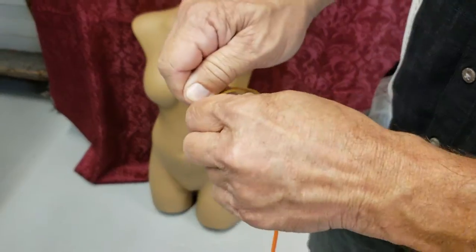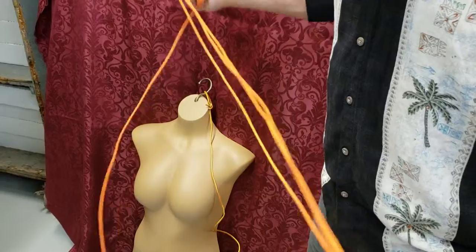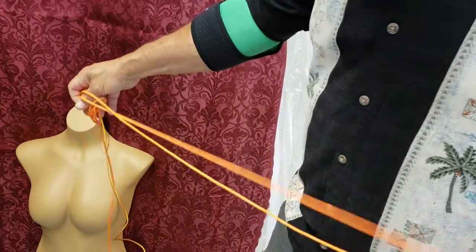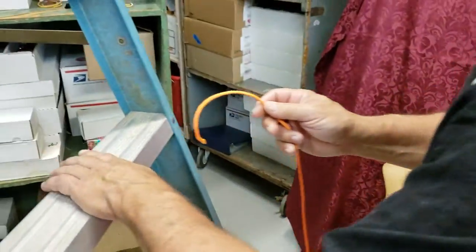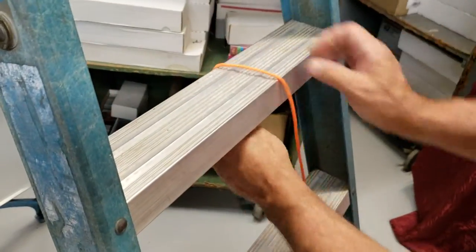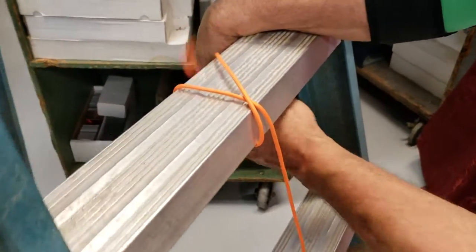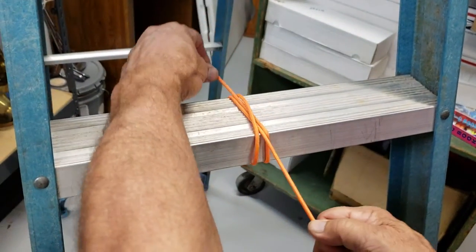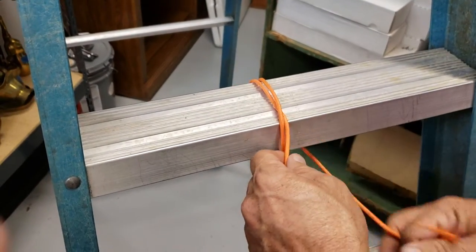Now that can get me up to the top. I'm just going to simulate what I would do up there, because I don't want to stand on a ladder and try to tie a knot and film it. Let's presume that this was the joist up there. I'm going to go around it like this and make an X, then go back around it again and go underneath that part of the X. And that is a clove hitch — perfect for tying rope to a beam.